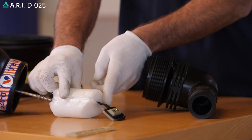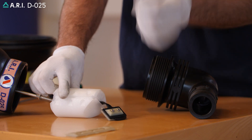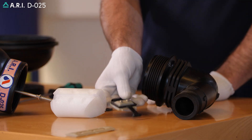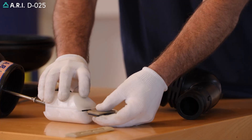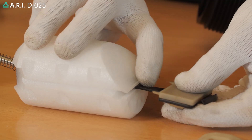We're going to check the integrity of the rolling seal. If it's damaged, cracked, or needs replacement, we could slide out the rolling seal from the float assembly and replace it with a new rolling seal unit. We're going to slide in the new rolling seal assembly in the float groove and make sure that the middle part of the rolling seal is aligned with the parting line on the float.